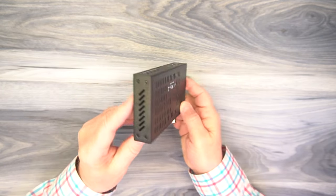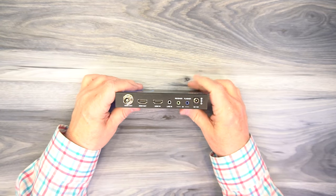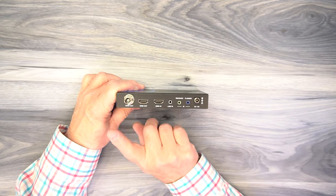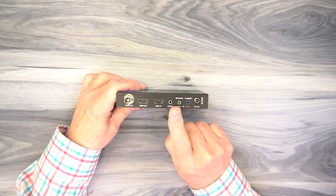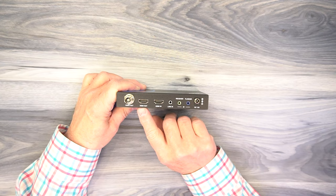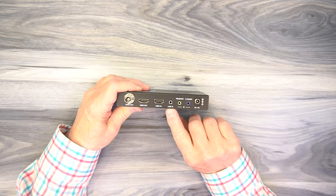On the bottom of the unit as well as on both sides you'll find ventilation slots designed to let any heat that develops during operation escape and keep the electronics inside at a comfortable temperature. On the rear of the unit is where you'll make all your connections. Starting on the left you'll find a coaxial connection — that's where one end of the RG6 coaxial cable connects between the transmitter and receiver. To the right of that are two full-sized HDMI connections: HDMI in and HDMI out. The HDMI in port connects up to whatever media device you'd like to share content from, using a standard HDMI cable. The HDMI out port is used for the local loopback functionality — connect the second HDMI cable from here to a local monitor to enjoy that content. To the right of those is the line input, a 3.5mm input where you can inject audio to send to the remote location.